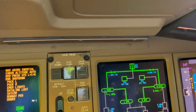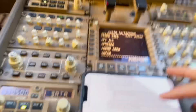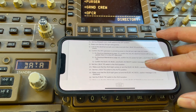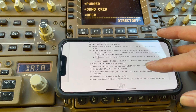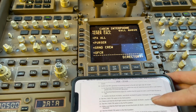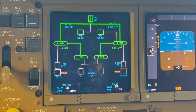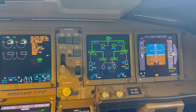Here you are — this one is closed, this one is closed, that one is closed. That works perfectly. Confirm APU is providing electrical power to the left and right. You see the green lines coming from the APU generator to the left and the right-hand side. The external powers are available — green — but you see the white light, so they are not feeding the airplane at the moment. That's good.